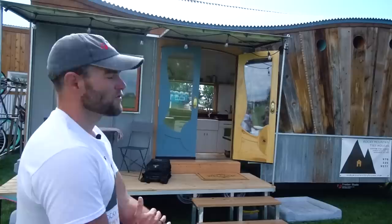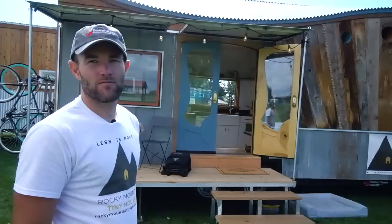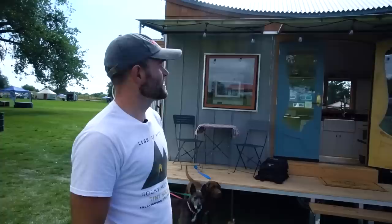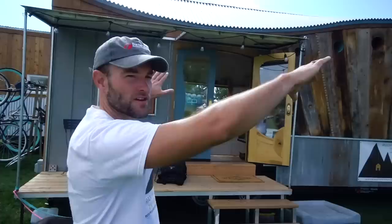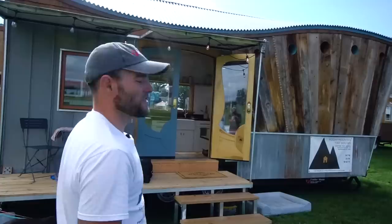The roofing is all new material — I don't like to put reclaimed stuff up there, I need the durability. That's corrugated 7-8 corrugated, 26 gauge, a little thicker. We thought it would be troublesome trying to bend it to the radius of the roof, but we just started in the low spot and worked our way out and it really just conformed kind of nicely. We didn't have to do anything special — it was gentle enough slope that it fit.